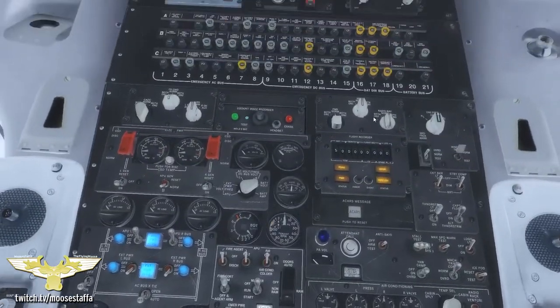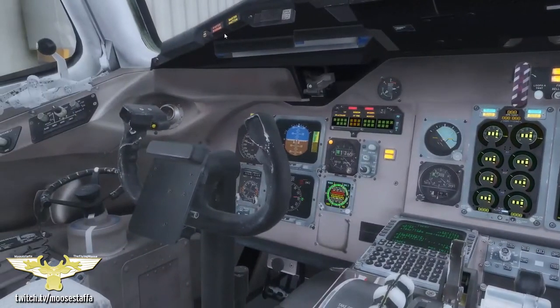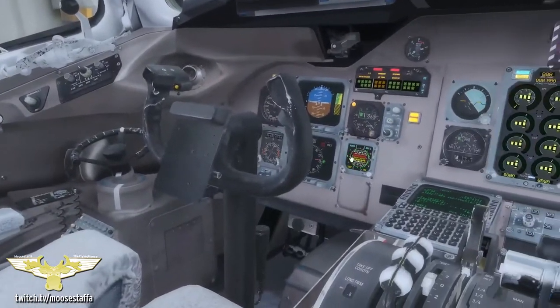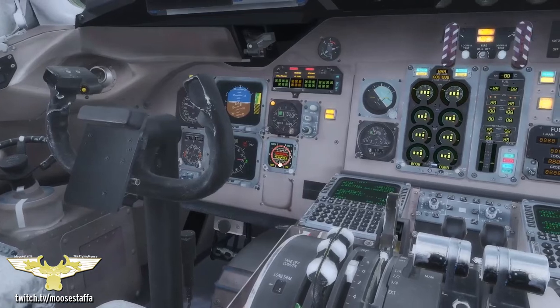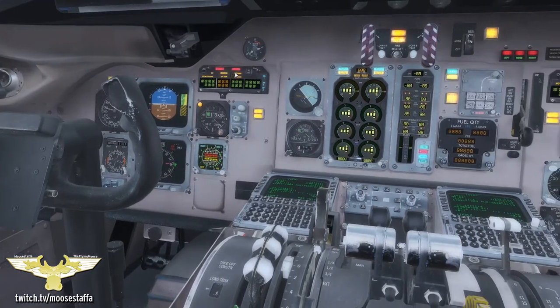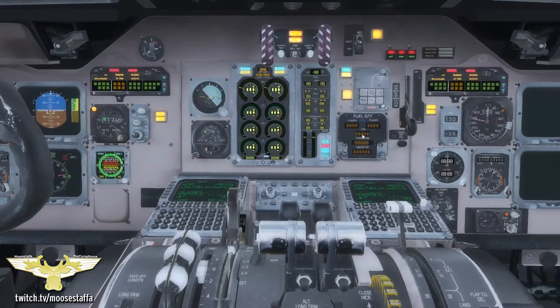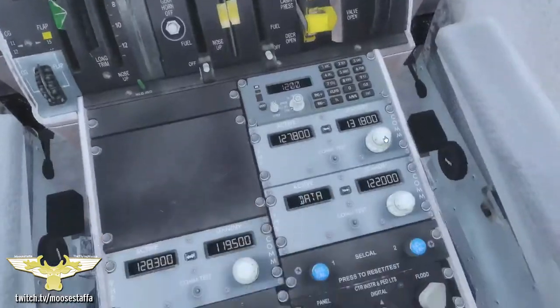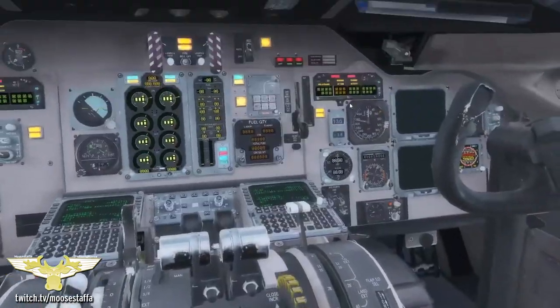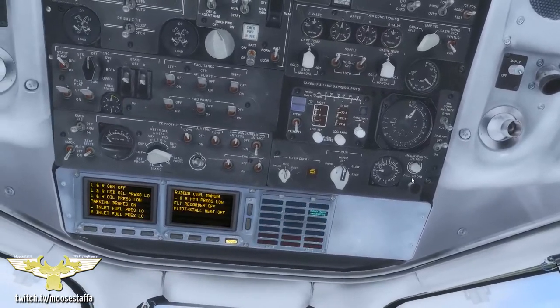and you're checking for all of your lights, basically. We're going to look down here around the cockpit. We should see those master caution lights. We've got the vertical speed with the TCAS displays, the autopilot displays basically here, engine instruments. They're basically all just running through these tests to show you all the indications. And you just want to make sure you don't see anything obviously burned out. So once that's done, you can let that go.